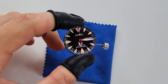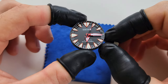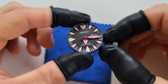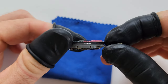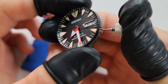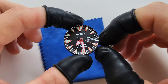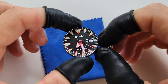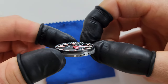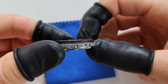You need to check the alignment from all four positions — 12, 3, 6, and 9 — to make sure the hands don't touch each other. Here it's perfect as well. Usually if 3 out of 4 positions look good, the last one is the same. Like in this case: absolutely perfect.